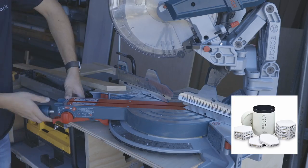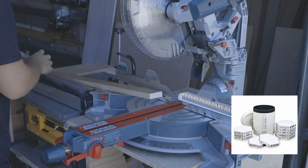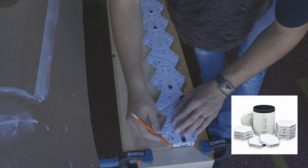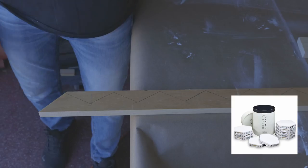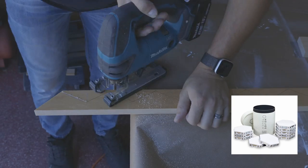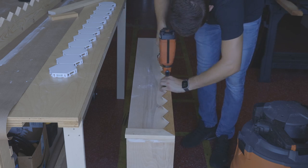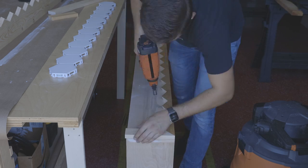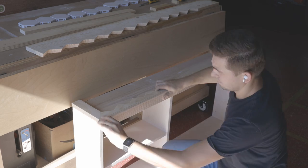I have Helios touch hexagon lights but didn't really have any use for them, so I got this idea to use them for this project. I cut out a 3-inch wide and 52-inch long pine plank, laid out the hexagons, marked the cutting line and cut the plank to the pattern I need for these lights, then nailed the pieces together with finish nails, sanding everything down and getting it ready to be painted.